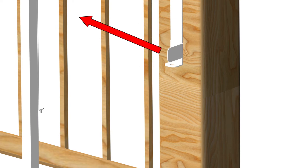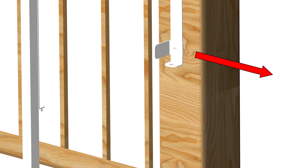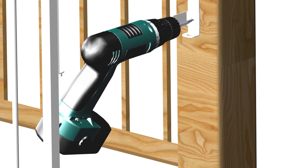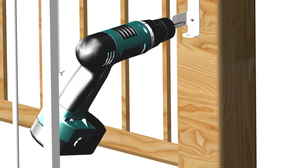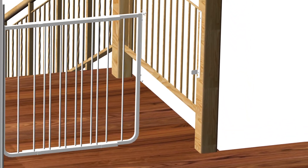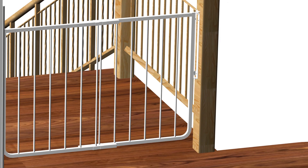The gate can now be opened in both directions. If you prefer the gate to swing in both directions, Step 4 is complete and you may proceed to Step 5. If you prefer the gate to open only in one direction, install the optional one-way stop bracket Part M before inserting the Phillips screw at the bottom of Part H. Place the slotted hole against the latch bracket with the long side oriented where you don't want the door to swing open. After deciding which direction you want the gate to swing, insert the Phillips screw Part C and tighten using a screwdriver. This concludes Step 4.